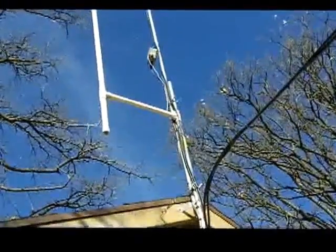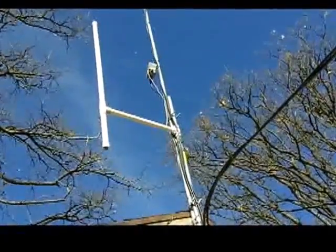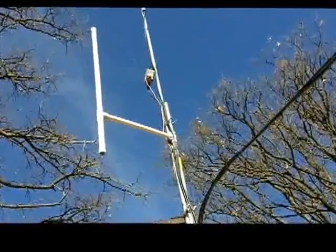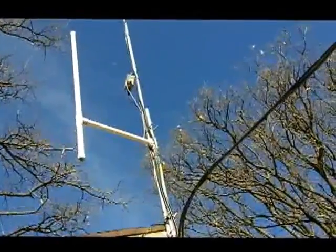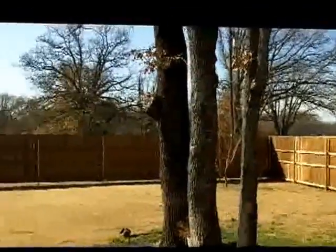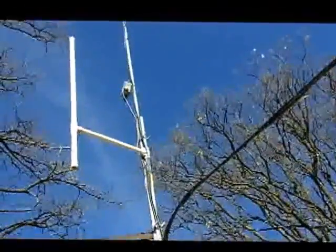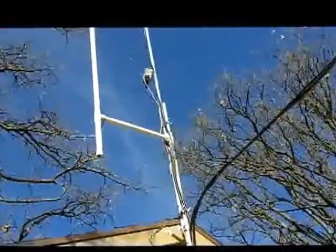That's a long wire all-band antenna. I can get 160 meters on it all the way to ten meters. It runs over this tree, down to that fence, and then takes a left-hand turn and goes down the fence. It's about 127 feet long — an end-fed long wire. That's what I use for HF, and it seems to work quite well.